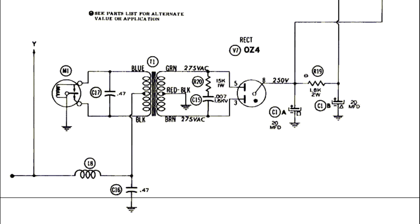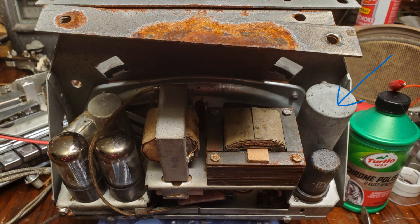So how can we remove and refurbish our vibrator? First, you need to remove the radio from the car. If you have a '55 or '56 Packard, I'm putting detailed instructions in the description on how to remove the radio — it's also in the accessory section of the '55-'56 service manual. Once you have the radio components out, you can see the location of the vibrator — it's the gray can. Keep in mind that this picture shows the apparatus upside down; when it's in the car, all those tubes point down.